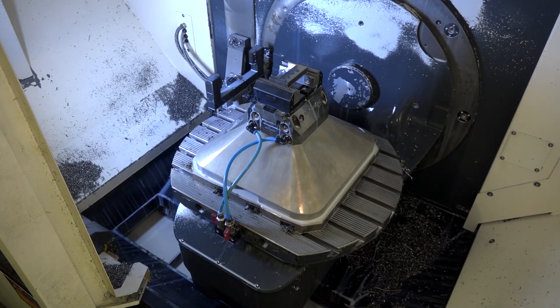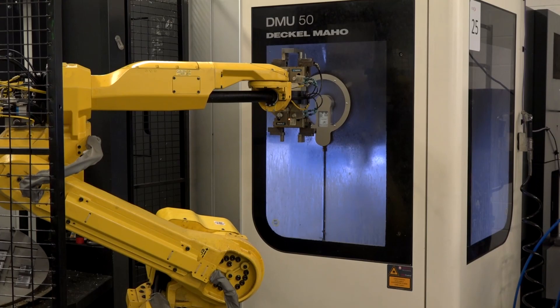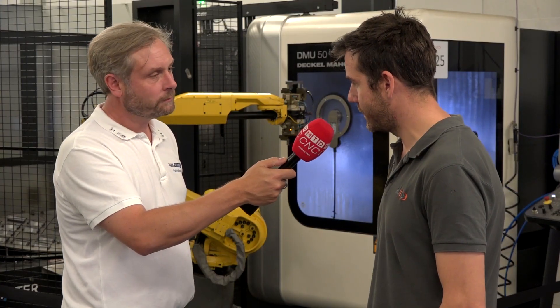In terms of full five-axis simultaneous machining — the B and C axis swivel — you can more or less do one-hit machining. You can put a part in there and, where before you would normally have to rotate the part several times to get to every face, the clue is in the name: five axis — you get to five faces at the same time.